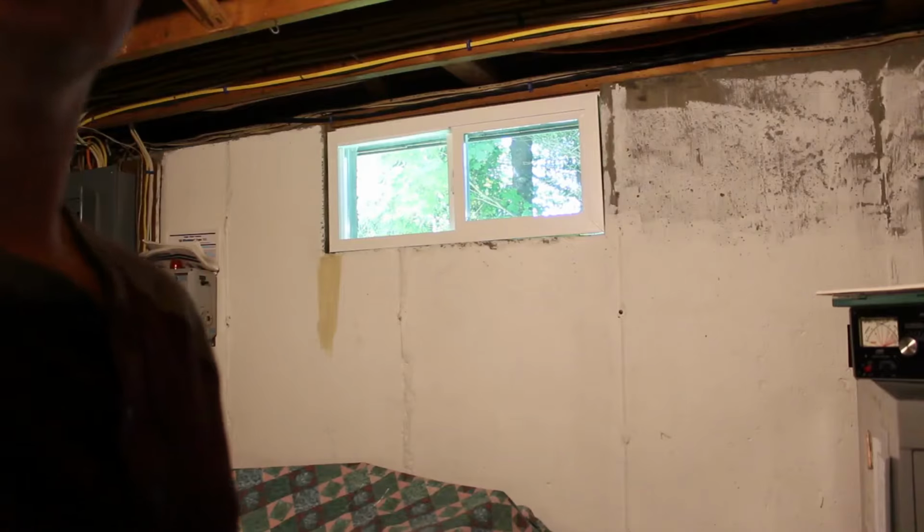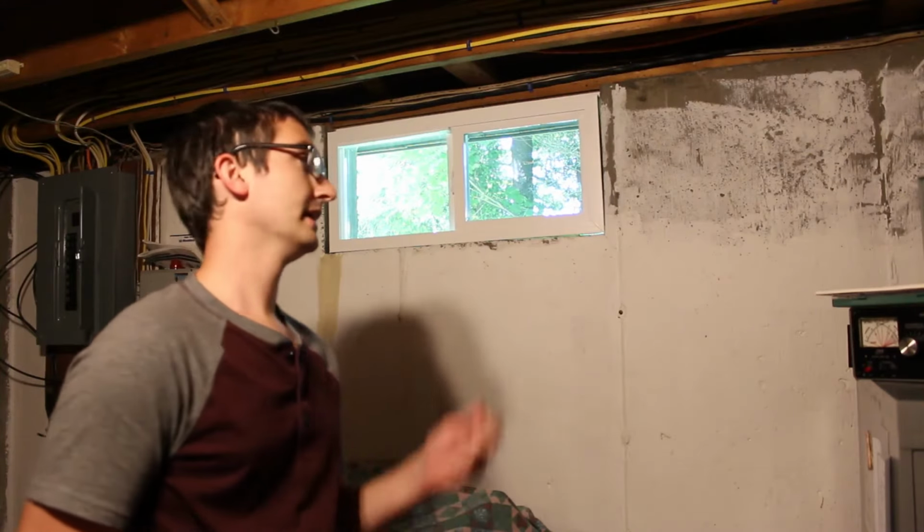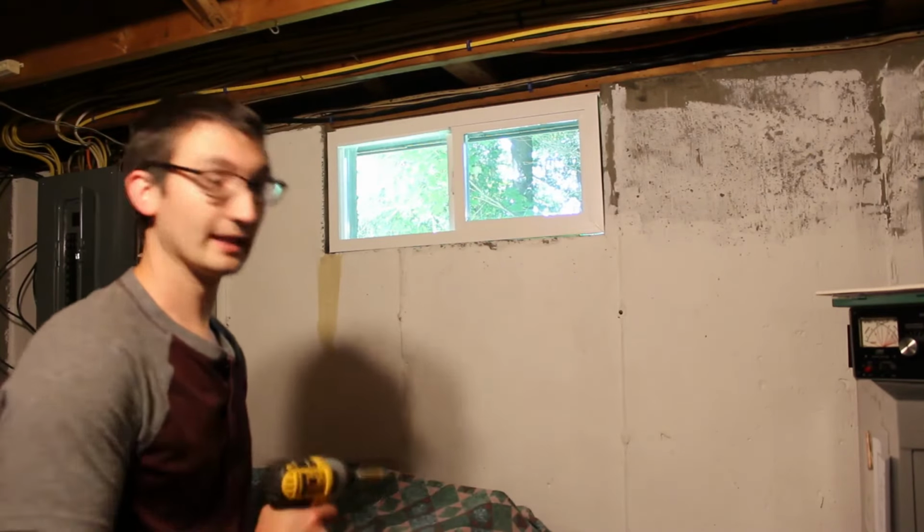I'm going to go ahead and screw in the top and then caulk the outside. I have a hammer drill on order for the Tapcon screws on the side, so that will hold until I'm ready to install those. Now we're going to install these windows with some screws. I'm using general purpose construction screws, a little over 1.25 inches long. Not ideal if it's going to be a finished screw. Something pan head and rounded for a better finish would certainly be better, but it's what I have.